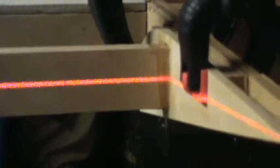Now ready to go ahead and epoxy that spar into the end ribs using some T88. And we know that everything as far as the spar and the two end ribs is going to be in perfect alignment then. So we'll go ahead and set some T88 into those joints and we'll let that cure overnight. Okay, one last check. Oh, look at that T88 ooze. One last check before walking away and leaving this thing to cure and doing something else.